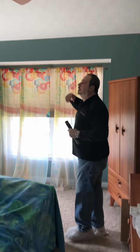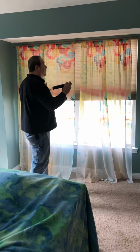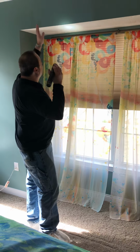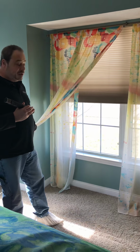All right, for the master, so again, we opened up all the blinds just to be able to see. Smoke detector, vaulted ceiling. Just want to make sure as far as any kind of separation, gaps at the apex or any water, ice damming or anything like that's going to happen, or patches or repairs. Didn't see anything like that. This little section in the front kind of jettisons outside of the exterior of the brick. So sometimes this flashing will fail and it will lead to water intrusion spots and stains, but didn't see anything like that. House is kind of new still, so 15 years is hardly anything for a house.